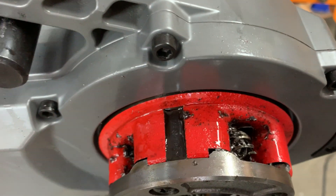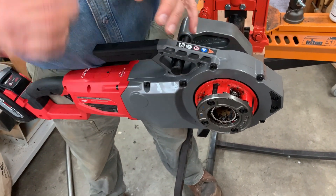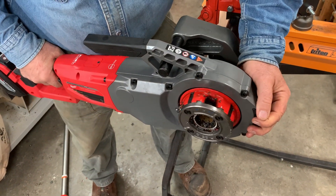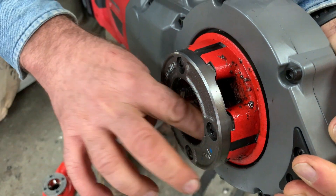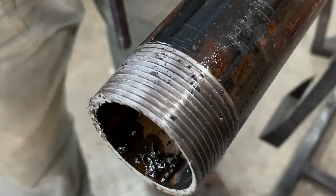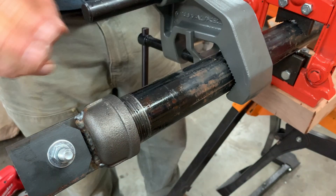That's the thread done and all that remains is to change the direction of the machine and back it off. There's going to be a little thunk — it happens when all those ribbons of steel have been cut off and then it just kind of unthreads. There it was. Now before I cut the next threads I'm going to get rid of the bulk here. The threads are quite sharp so you have to be careful, but look — terrific threads in record time. One person, and this now threads on perfectly. You saw how clean the threads were.